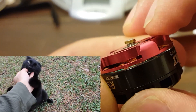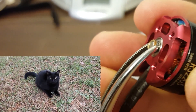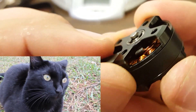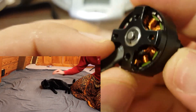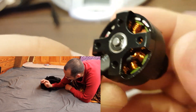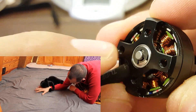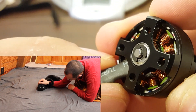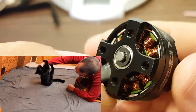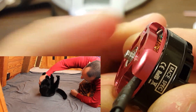The next thing we see is this brass bushing here. That is to provide some spacing between the clip and the bearing. Not all motors include this bushing. On this RCX motor, the clip is right against the bearing, which may not be an issue immediately but could be over time. As the clip turns, it's going to press against the bearing. The clip does rotate with the shaft — you do not want a situation where the clip is stationary and the shaft rotates inside it, because the clip will wear away at the shaft and eventually come off. On higher-end motors, this brass bushing provides a little protection between the bearing and the clip.